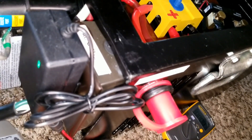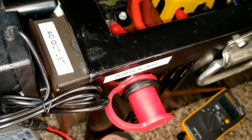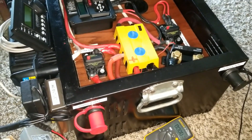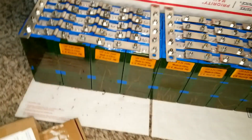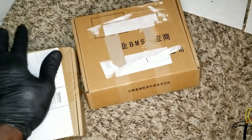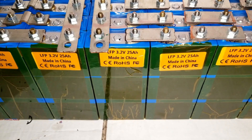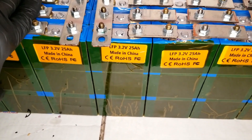I don't have any packs right now that are ready for a full charge demo — there's just a 12V configuration sitting here. I also want to review this LiFePO4 battery and related materials that came in. There's also a BMS — a battery balancer — that arrived today. These LiFePO4 cells are 3.2V each, so I can't use this charger on them because it would ramp up to 16.8V, which exceeds their voltage specification.